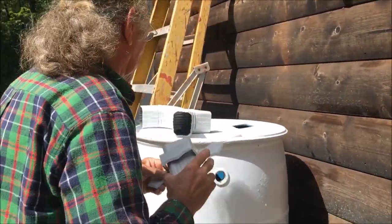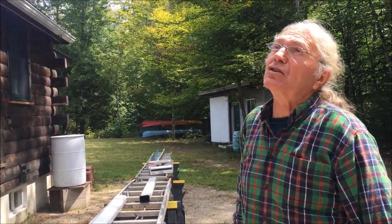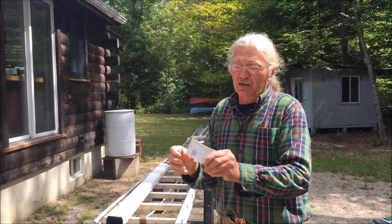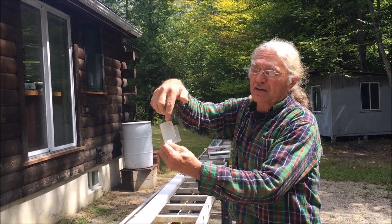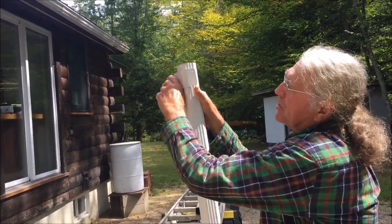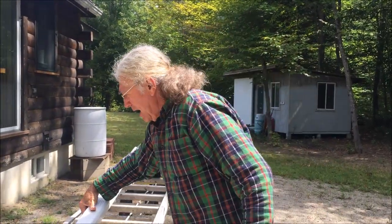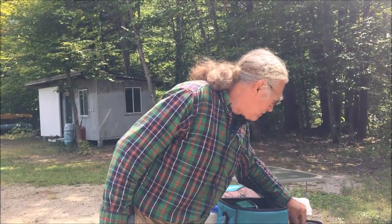And these will be screwed into the building and the downspout. Now, if you end up going to a larger downspout and a larger gutter, these are 2x3 downspouts typically, and then there's a 3x4, and this would be a bracket that's used for the 3x4, and it screws to the wall and then has screws that attach to the two sides. So technically it would kind of look like that from the side, but obviously this is a narrower downspout. But if you had the bigger downspout, that would be the bracket you use. Most applications you're going to have a 2x3 downspout.